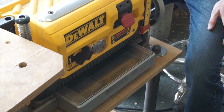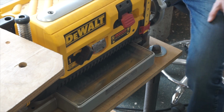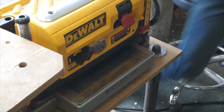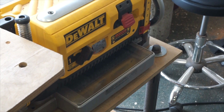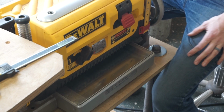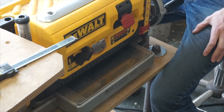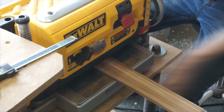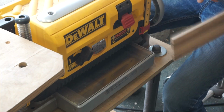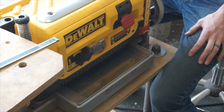Now I go back to the planer to bring this fretboard blank down to its final dimension. Well, not final dimension, but to the dimension I need for it now. Its starting dimension, really, which is 0.27 inch. Now through the process of the build, it's going to get dimensioned and thickness further down, especially when I get to radius sanding. I'm going to lose a lot of thickness then. But for now, 0.27 inch is just a good starting point.